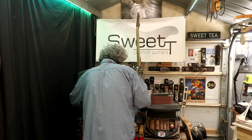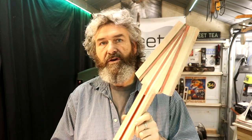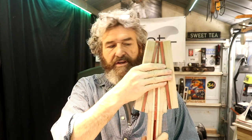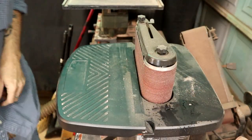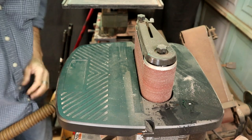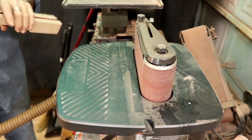The first thing we need to do is plane the face of this down. The back side of the headstock is going to be a little more difficult — I'll probably have to use a block plane or take it over the spindle sander to get the back of this thing flat. All right, we're over at the spindle sander now and we're just going to flatten this headstock out real quick.